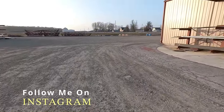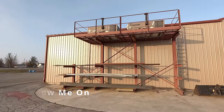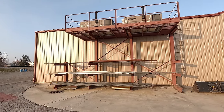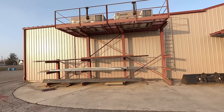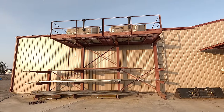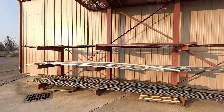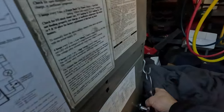We're out here to do a no-heat call. Up there are two package units — state-of-the-art LuxAir garbage. I can smell from here. They say you can't smell carbon monoxide, but when they go all to pieces like they're doing right now, it's going to be completely plugged up. You can see black around the exhaust pipes, which are kind of engineered-looking. These are likely running on propane because we're out here in the middle of nowhere.